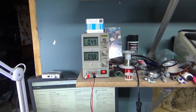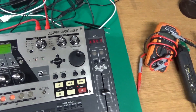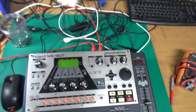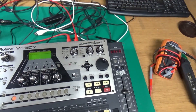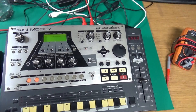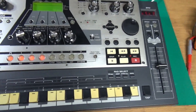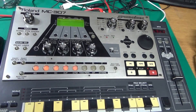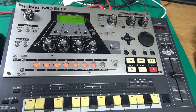On the power supply you'll see I'm drawing about half an amp while it's loading. One good way to test if the 307 has a blank screen: it'll go up to 0.8 amps when you first turn it on, then down to 0.3 amps with the blank screen — meaning nothing's happening. That gives you an indication that the CPU is waiting for a command. When it has nothing to do, the current draw went down to 0.3 amps. Now it's on to test three.